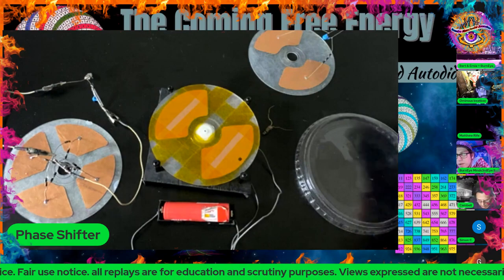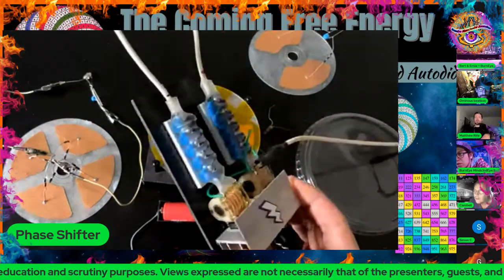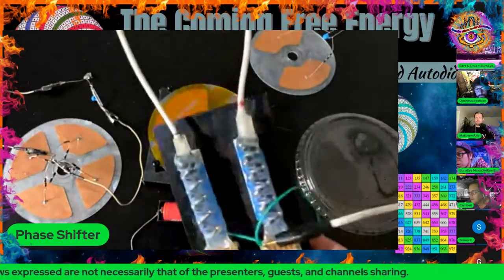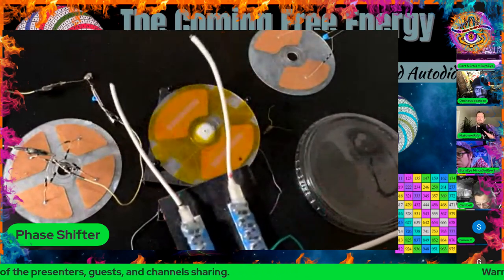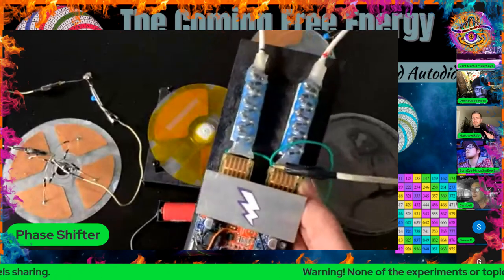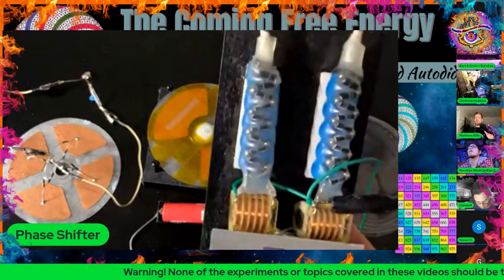Yeah, actually, the 2CL71, that's what's in this charging multiplier. This thing has like a 40 or 45 kV output per side or something like that. And it's a split rail, so one of those sides is positive, one of those sides is negative. So I get pretty decent long arcs, about 3 or 4 inches between those. Just as a reference of what it can do for a practical purpose, but that's all being run off that same series diode there.